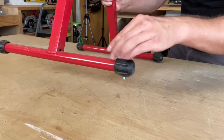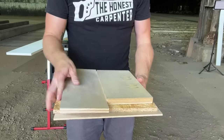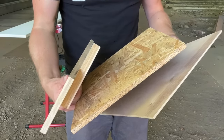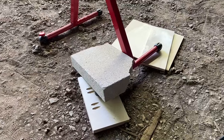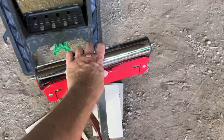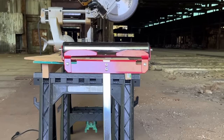This can be kind of tricky because the stand may be riding on a lot of lumps in the ground. Some roller stands, like my WorkPro, have foot levelers which can help. But more often than not, I've kept stacks of little wood blocks of different thickness with me — mostly quarter-inch blocks, half-inch, and three-quarters. Experiment with shimming up your roller stand with these until you get a level platform with your cutting surface. It can also really help to weight your roller stand down. Once you have it leveled off, you may want to weight the feet with something — just dead weight. These stands have the tendency to walk if they're not well supported, so just pin them down with something fairly heavy. It's a good way to ensure better stability.